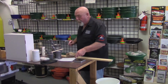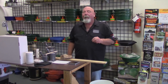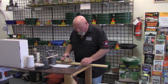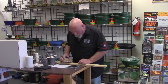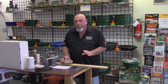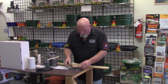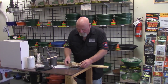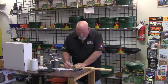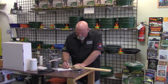To do the test, we have to have two measurements of the golden quartz specimen piece — this one completely dry, and then the other one submerged in distilled water. So right off the bat, we are going to get our dry weight, and this is all done in grams. You don't do anything in grains or ounces — it's all done in grams. Place your golden quartz specimen piece on there, and jot it down: this is 1574.5.